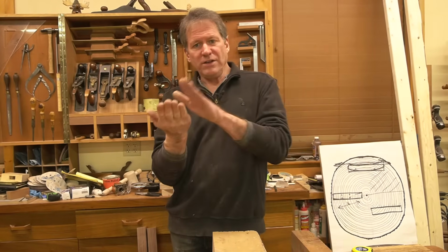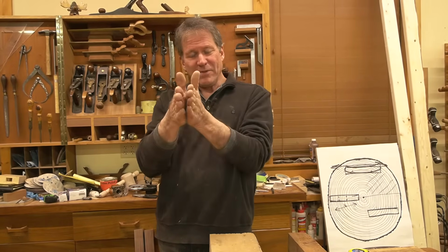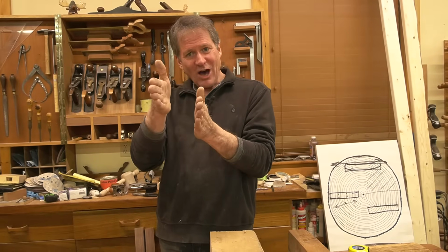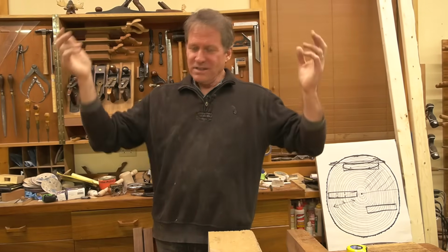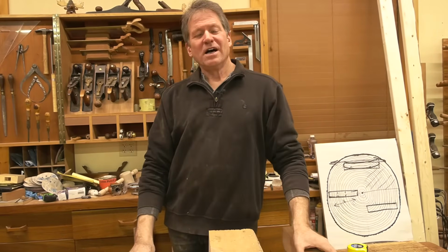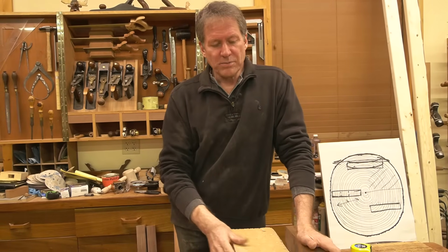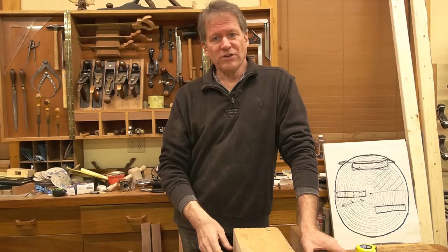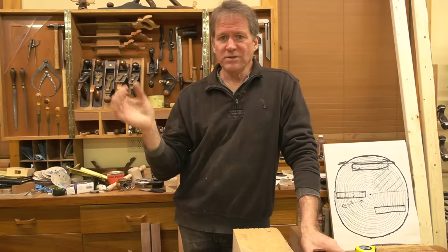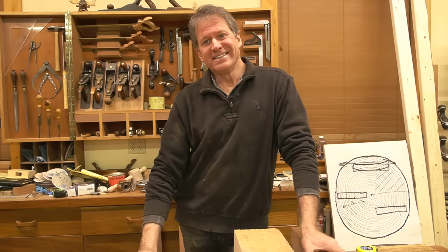Typically, all the interior core is going to be flipped up on edge. And if it's plain sawn to start with, you're going to just rip it, dress it, and flip it up on edge. You're going to have quarter sawn along the top, and then you're going to skin over it, and you're just going to have a rock solid, stable core there. It doesn't hurt. I think oak on the interior would be a bit of overkill. Plus it's going to add a lot of weight to the door. As long as you get that oriented quarter sawn and you're going to skin it over a 1/4 inch material, that's going to be beautiful. Yeah, those are great. Yeah, it's good.